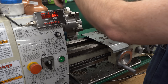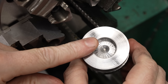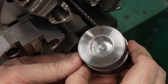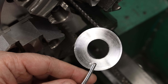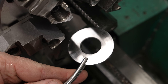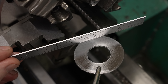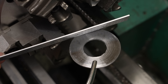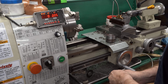Let's see what the surface finish is like. I was probably tighter than I needed to be — I was nervous, my heart was racing — but that's a nice smooth surface, just like I got on the one-inch part. That looks really good. I've also got a slice here — one of the pieces we cut off. You can see both sides look pretty good. The parting tool is doing pretty well on both sides; that would be perfectly acceptable for many parts without any further processing. In fact, this side is super shiny. The steel is smeared rather than being cut cleanly because the tool is rounded and not sharp, but I'm still impressed by that.